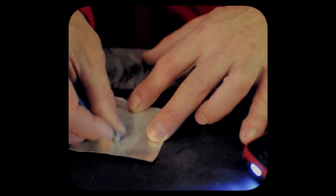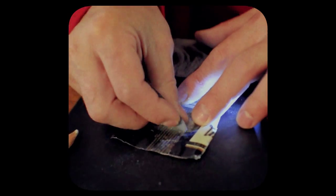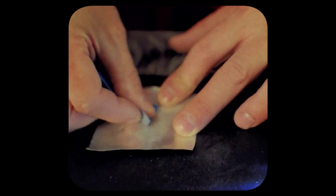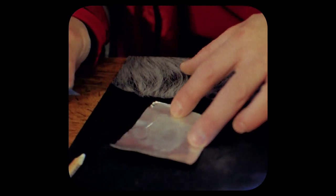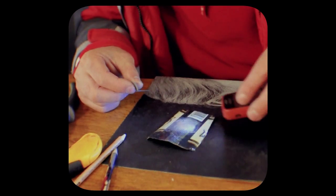The labeling of polishing paper from different producers may differ and you might be tricked by them. I usually use polishing paper of two grades. The main one is number 2000 — it's a very fine one and is usually used by car painters, resembling ordinary paper by touch. For the final stage I use a paper with a larger abrasive number. The better you polish the surface with the defined paper, the better picture you will get.